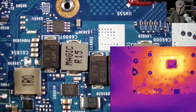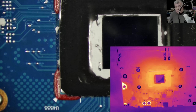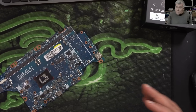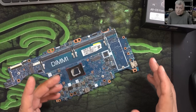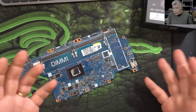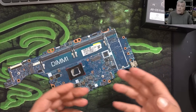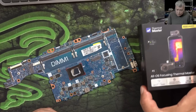This thermal camera is really helpful for repairs because you are hands-free: you have the picture from the normal microscope and from the thermal camera simultaneously. The biggest advantage is the camera has a manual focus, which is important because you want to adjust the thermal camera for different working distances — or get closer for phone repairs.